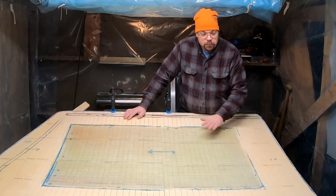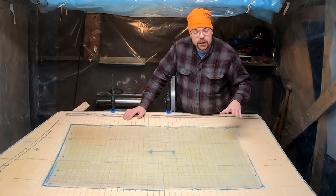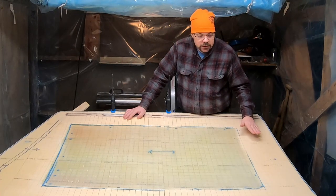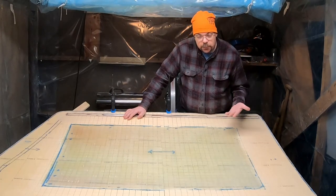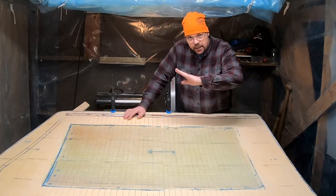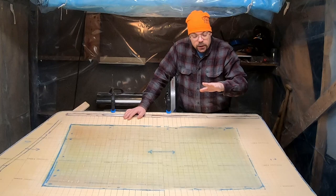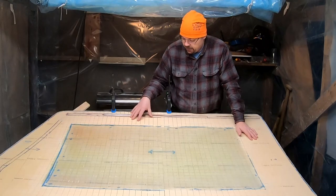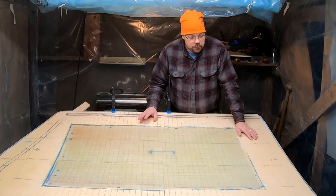As you remember from a couple of movies ago, you can see it up here, I put in a couple of layers of 300 grams biaxial with epoxy resin under this foam. Also, when I turn this upside down, when I'm done on this side, I'm gonna do some fairing and sanding to get the shape of the roof really good on the outside, and also put at least one layer of fiberglass with epoxy resin there to get a really, really good outer surface. More about that later.